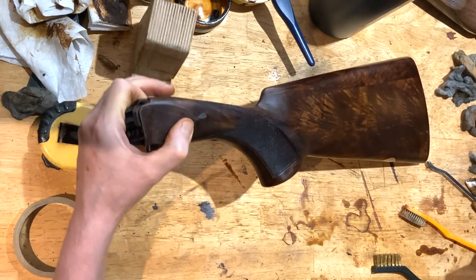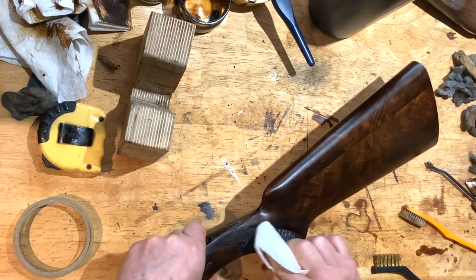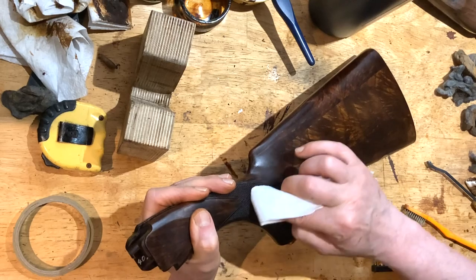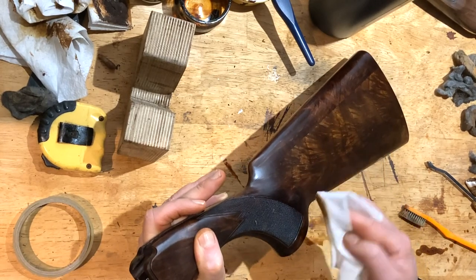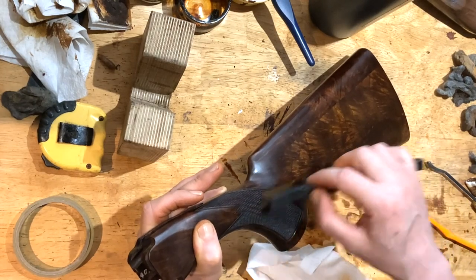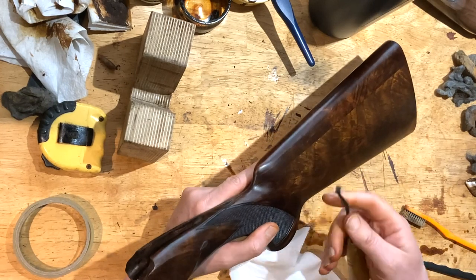Okay, because what we're going to do is take a clean piece of cotton wadding or cloth and immediately take off the excess. Basically just clean it up. Look at the dirt I'm picking out that's lifting out of that. That's something you should do in your normal gun cleaning routine. This could be done once or twice a season just to ensure that you've got all that dirt out. That could be residual staining or anything from my work, but there you go. Just use your little brush there to lightly make sure there's no bits of lint stuck in there. There we go. So now I will clean up the checkering border with a single blade checkering tool,